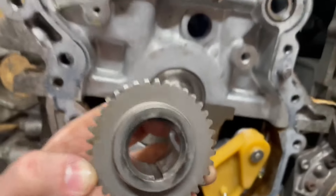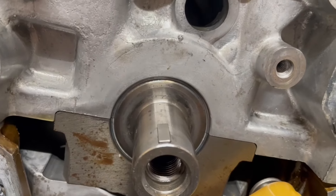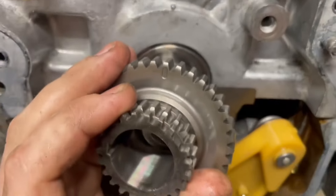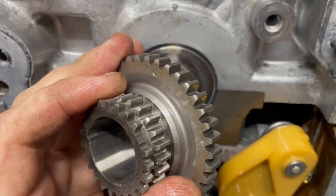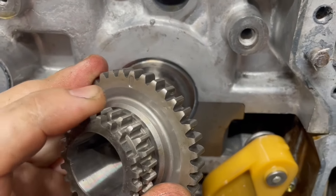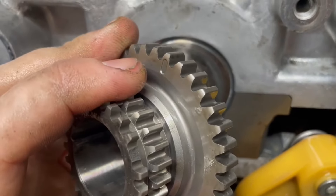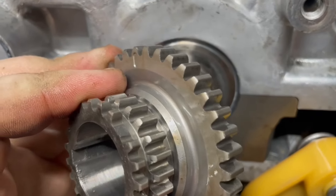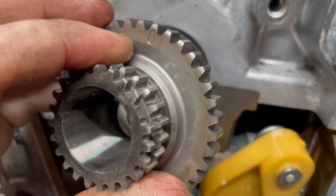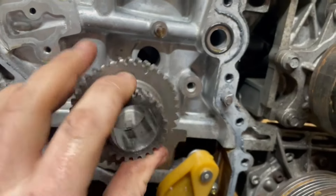This had so much torque going on to it that it's pulling the keyway. It is not perfectly square anymore. And then I also found — after pointing out that premature wear — we're missing a tooth. That is on the outside of where the chain sits, but you can see that wear on the edge, and it broke a tooth off. There's no corrosion on that, which means it probably happened fairly recently. I should find that tooth in there somewhere, or it might be in the oil pump. I think we're starting to find the limit of what these cast gears can take as far as torque goes.